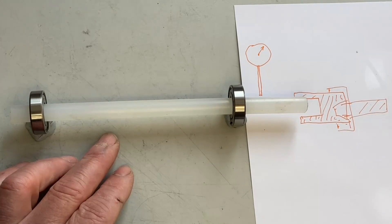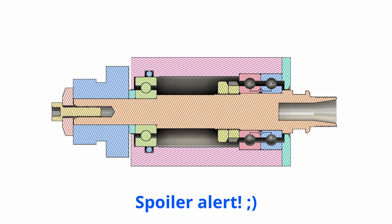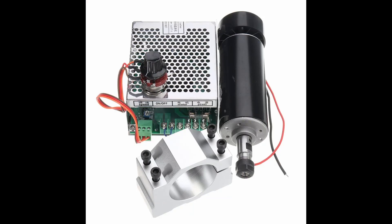To improve the stiffness of this, it needs a bigger diameter shaft, the bearings closer together, and the shaft and collet in one piece so you can get the tool right up and choke up on it to minimise tool deflection and the overhang from the spindle bearings. Those are the reasons I'm not happy with this design — I don't think it's letting me get the full potential out of the machine. I've decided to make a different spindle, a new one. If you're thinking about building a machine, I would recommend you don't start with one of these AliExpress spindles unless you only want to do PCB milling or very light engraving. A better option would be one of the water-cooled spindles that are around now — they cost more money and they're bigger, which is why I haven't got one.